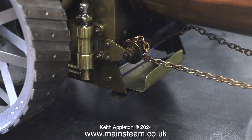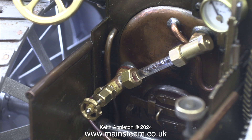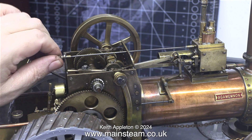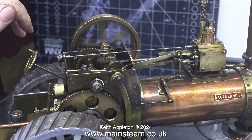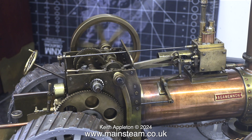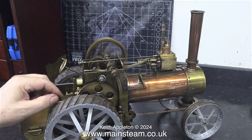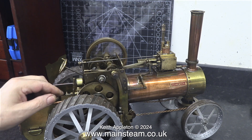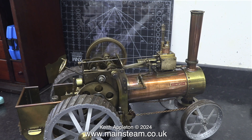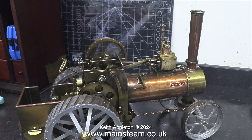After about half an hour I looked at the water gauge, and this is a sure sign that the water is starting to boil because it's moving up and down. When I open the regulator the engine starts to make steamy noises - nothing on the pressure gauge - but when I rotated the flywheel, off it went. Almost unbelievably, this engine is in steam. There isn't a lot of water showing on the water gauge because I drained some out to make steam raising a bit quicker, and there is no pressure reading on the pressure gauge whatsoever - but bear in mind I did set the safety valve to blow off at 20 psi and the working pressure really wants to be around 15.